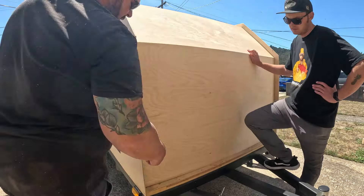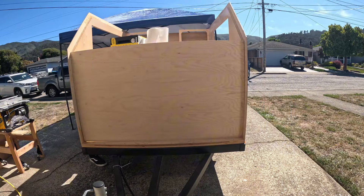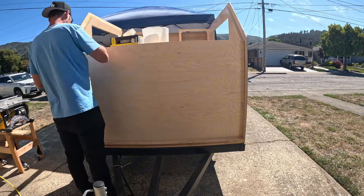There were only very small gaps but it'll be covered with some trim on the interior eventually anyway. So here's our first dry fitting of these parts and it looks pretty good. You'll see that there is a ledge there — if you've been following along with my videos you know that with the sandwich walls, the outside wall stands a little taller and goes down deeper so it can sit on the floor and the walls can sit inside as well. After the dry fit we said okay everything looks good, so we start applying our PL Premium and stapling the walls to that little shelf on the inside.